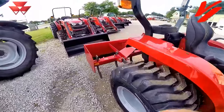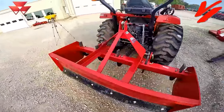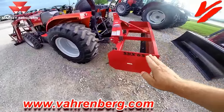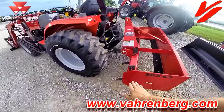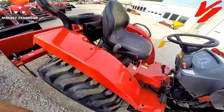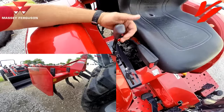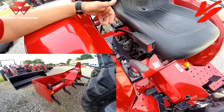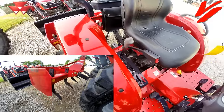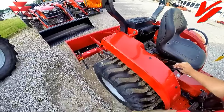We're going to fire it up and show you that it doesn't have hydraulic down pressure, and why you don't want hydraulic down pressure on your tractor. When the force goes down and pushes too hard, it's going to raise the rear wheels. Coming over to the tractor — you have a raise and a lower position. We lower the three-point and it goes down to the ground; we pull it up and it hydraulically raises. You can see we're low on the implement and gravity is just taking it down.